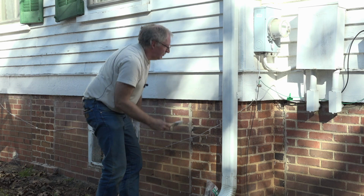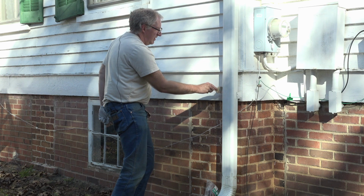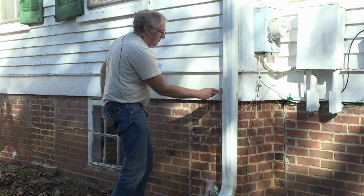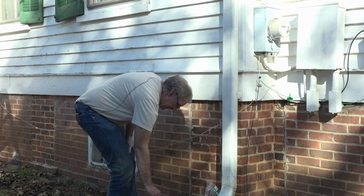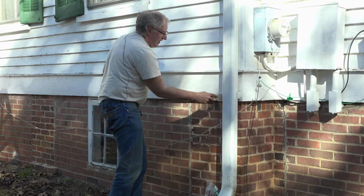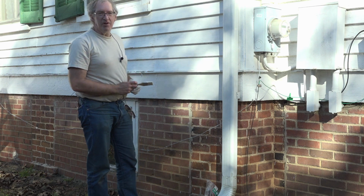The base coat that we put on here previously, a special concoction as we call it, was super watery to penetrate the wood fibers and make a good base. And now this is laying down on top of that, and this in turn will be a good base for the paint, the color paint, which is to follow. Okay, the primer is on and looking good.